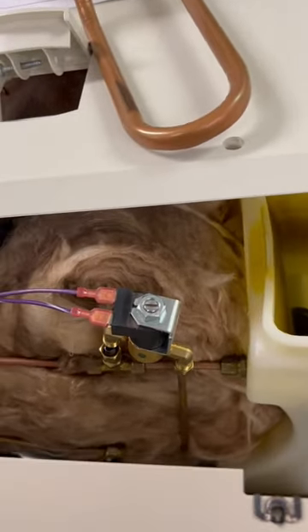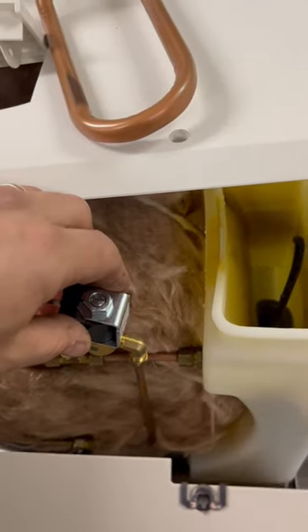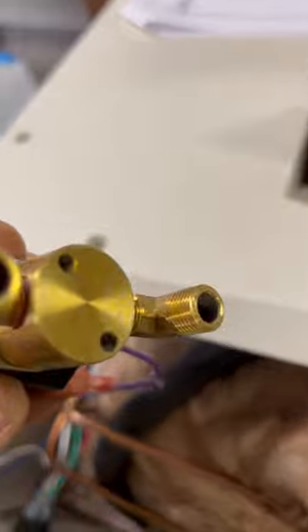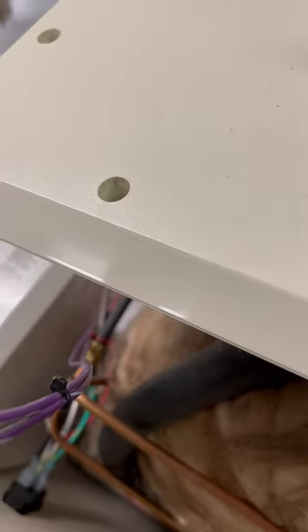The way I test it, it's really quick. This thing gets super hot so I'm not at all concerned about putting my mouth on it. I'm basically going to blow on that side and if I hear anything come through I know the valve is bad. That valve is bad.